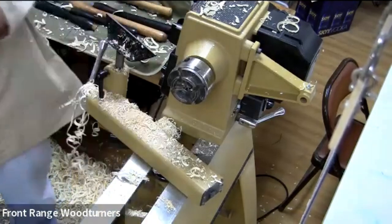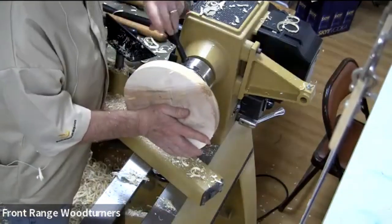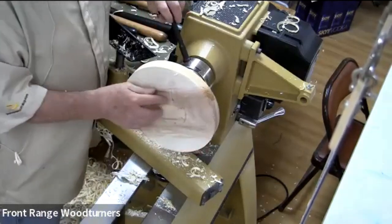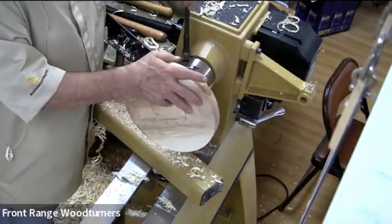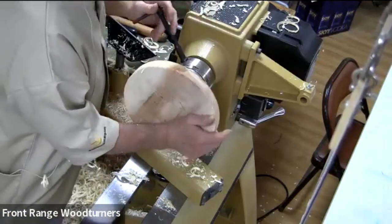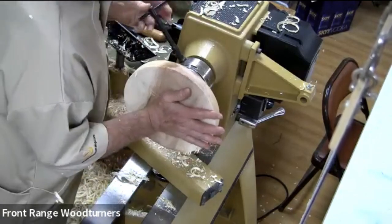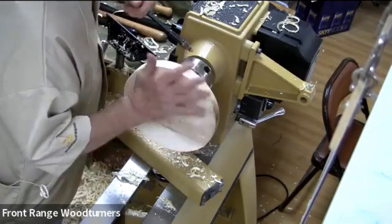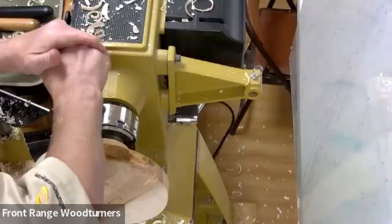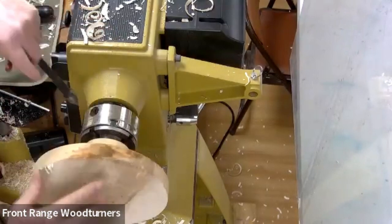Or two shots. Actually, I got a piece of maple that was spalted pretty good in the raffle. I thought about not taking it up to the car. I thought about leaving it here and making a hat out of it, just to show you that you don't have to start with a round blank. You want to get in there tight, tighten up your chuck. I could have made that tenon a little smaller, but it'll work if this spins true.